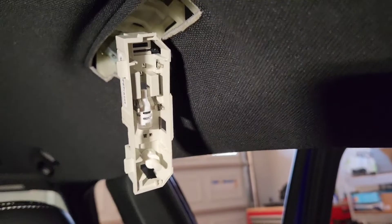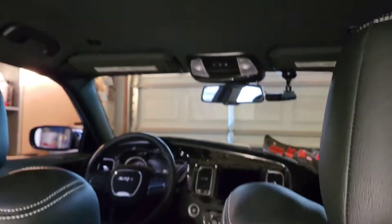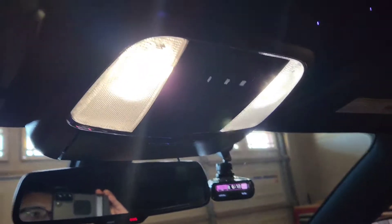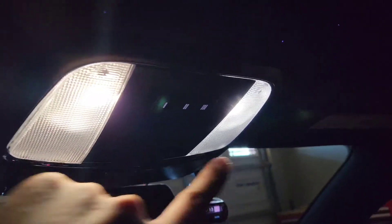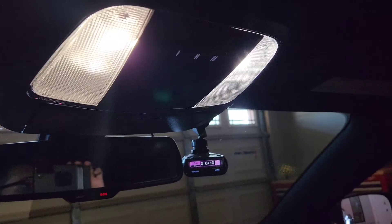It does work now — just need to replace everything and put it back. I'm going to do that side as well. Make sure you turn them off first because the lights get hot and it'll be hard to take them out. After you put the new ones on, turn them on using the little dial to make sure they're functioning, because you don't want to put everything back together only to find they don't work. So all are installed except for one. The ones that are on — I'll give you a quick shot of nighttime so you can see how it looks in the dark.